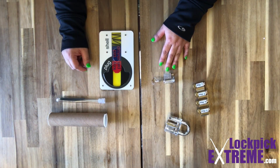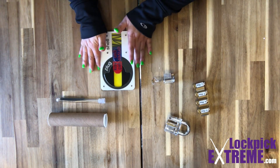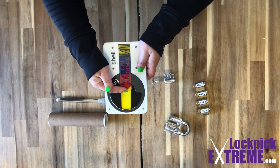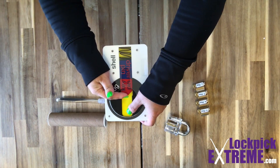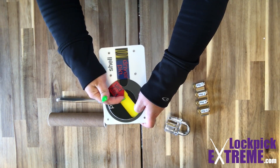So why can we pick locks? When we pick locks, we're mimicking what a key does. And like we said, the key does two things: it lifts the key pin to the right height and also gives us something to apply rotation to get that plug moving to the open position.